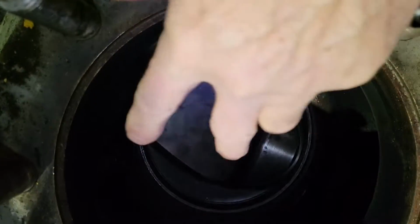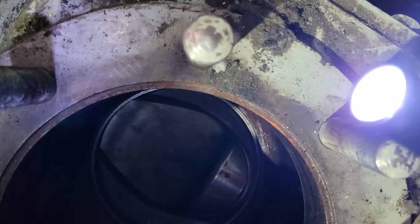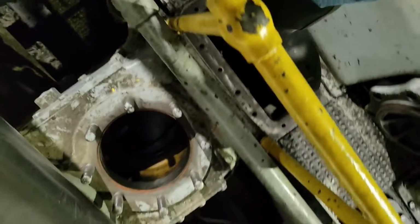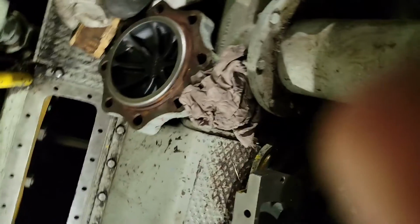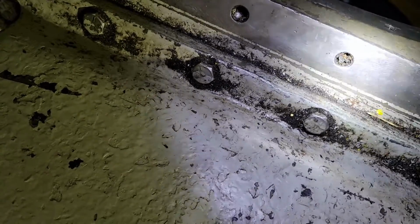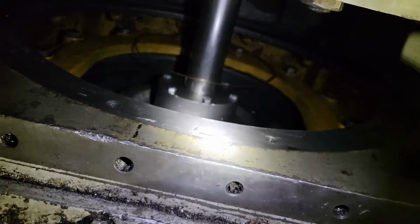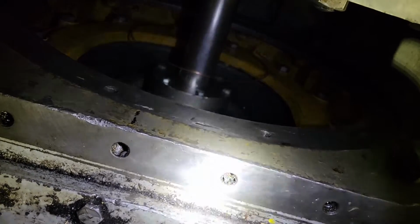The same sculpted piece here that lets the gas come into the piston there. C-shaped pieces, they'll go together and they form the inside seal for your distance piece where your scavenging air piston is. They form the seal here over that shaft, and then the chamber that's inside here for your scavenging air piston. That's what these guys do.